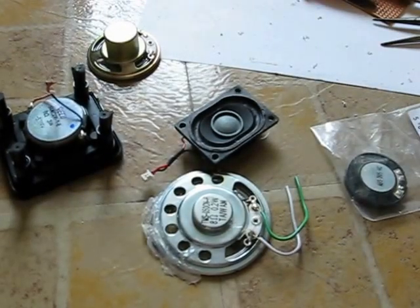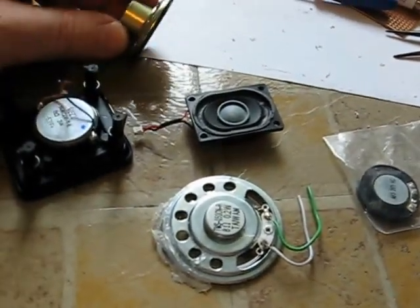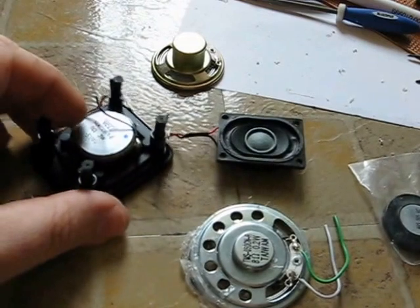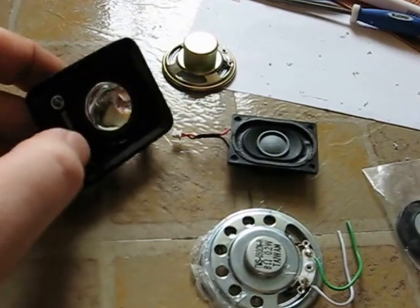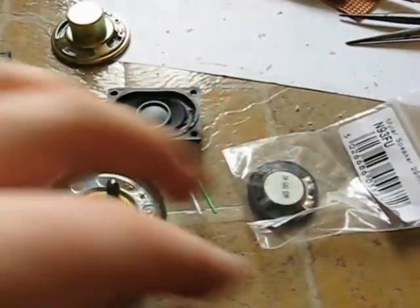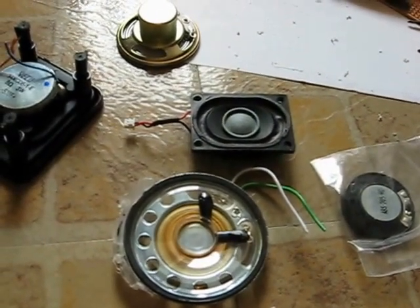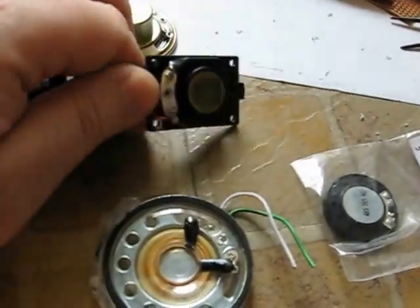Here's a good selection of speakers from different sources. This one from a PlayStation 1 screen has quite good audio but a thick backing on it. This one is from a mobile phone-compatible MP3 player type — you generally get the same type off little iPod players. There are also slightly bigger, much flatter ones and 30mm ones of the same type. The smaller the speaker, the tinier the sound and the less volume before distortion, but any of these types are perfectly adequate for a portable — it comes down to what you can get hold of and personal choice.